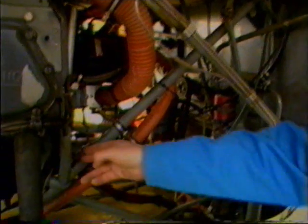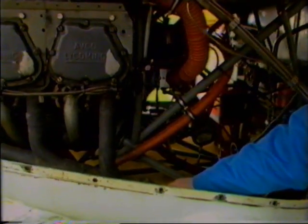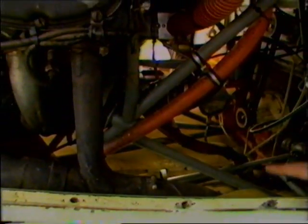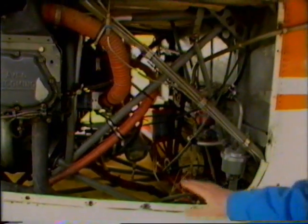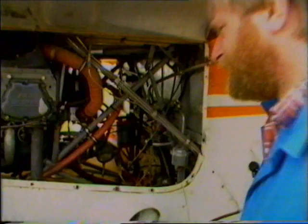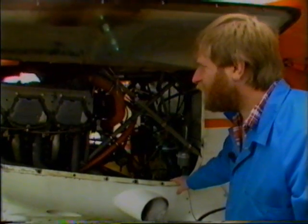all the rods are secure, pins are in the rods, there's no cracking of rods, there's no fuel leakages, the engine mounts, no cracking, the rubbers are secure, exhausts are secure, general condition inside is clean, there's no massive oil leaks. Checking for bird's nests. Birds do have a tendency to get inside. There's no leakage from the battery on the other side.